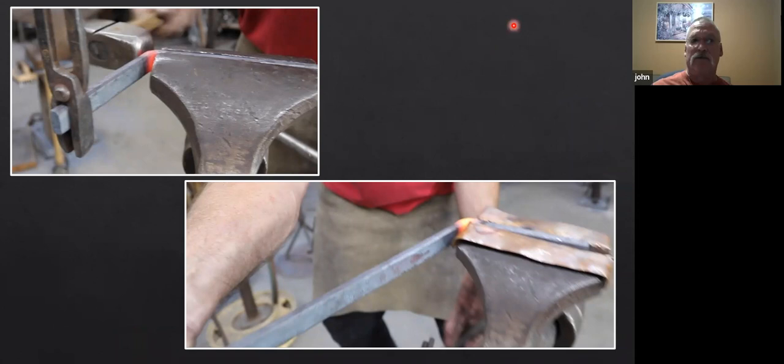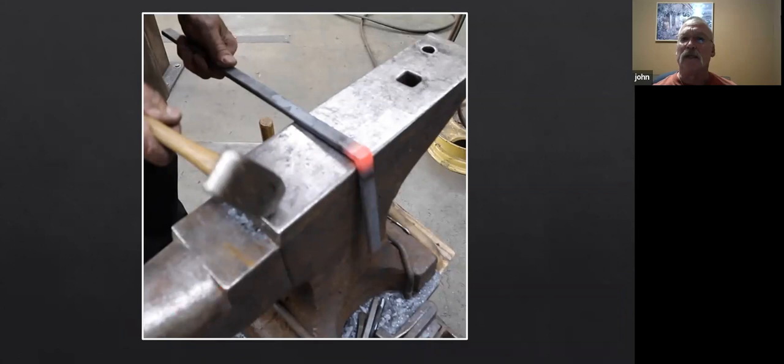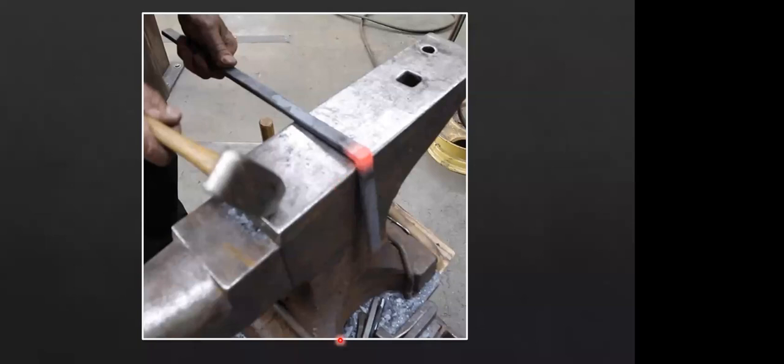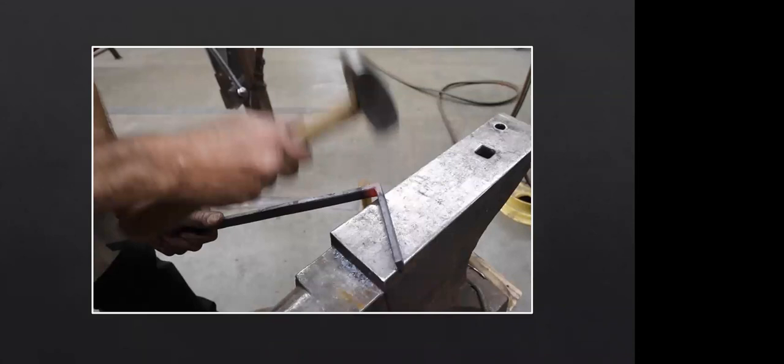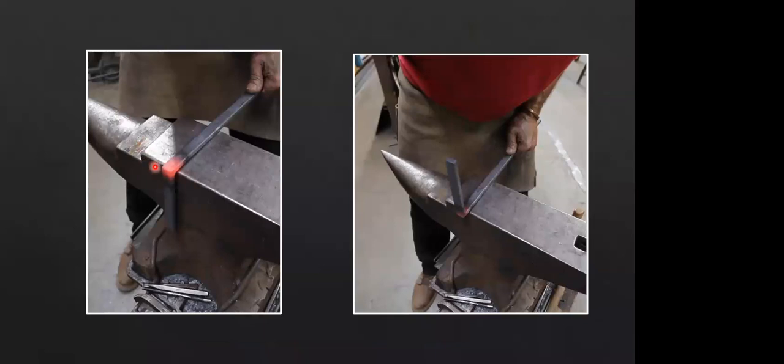It's just a nice bend — you put your center punch marks on the center of the bend on both sides, so when it's upside down and you're working at the other leg, you can still see the center punch mark. Here we're getting close to square and cleaning up the corners. You can see the lines closing in on each other for your sharp corner, and getting the chamfer all the way back into the corners. Here you see a nice sharp line — this is the final getting it to square — and then we're going to see a video on the square corner.